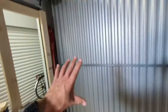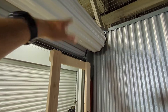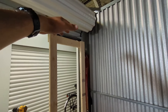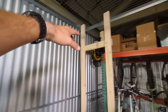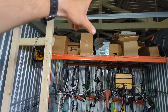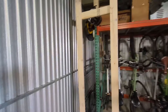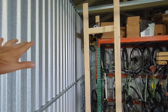This storage space is eight feet tall and the door is about six and a half feet off the ground. I did some thinking and calculating and figured that if I had a shelf that was 78 inches off the ground — which is what the top of this 2x4 is — I would have about 18 inches of space above that for boxes and stuff. That pallet racking is about two feet below the bottom of that wire mesh there, so a little bit shallower of a space, but that should be enough space to hang most of my frames. I also figured I needed about two feet to one side of a frame so it doesn't hit the wall of the storage unit.